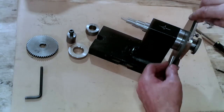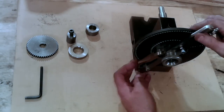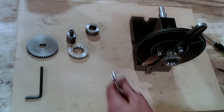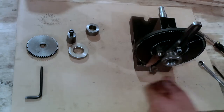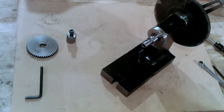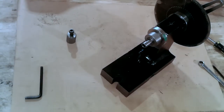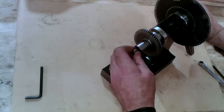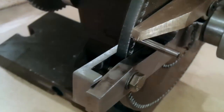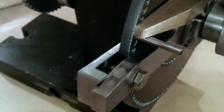The locking clamp is the next thing to be fitted, and for the moment is held in place by one 6mm hexagon screw. Turning the unit round, all that is required now are a series of collars or packing bushes, amongst which one will be the gear blank, before finally having the retaining sleeve fitted and held in by one 8mm high tensile steel screw. This is a shot of the locking clamp and the ground 4mm dowel that will assist the indexing. You'll notice that the sector arm is already set to 2 spaces.